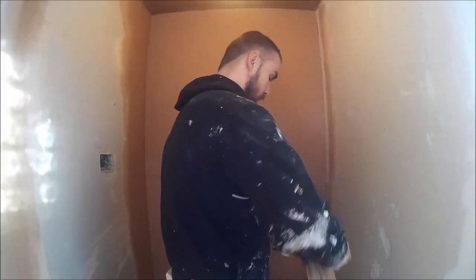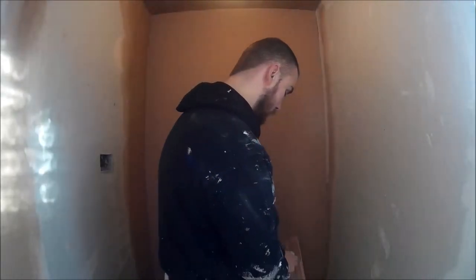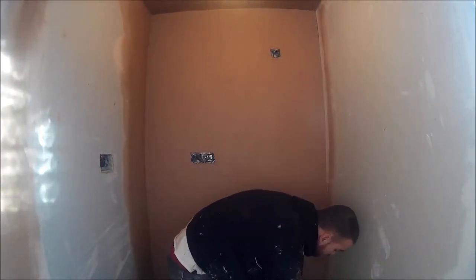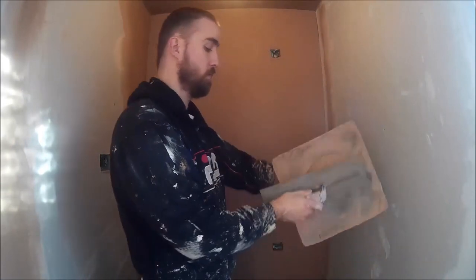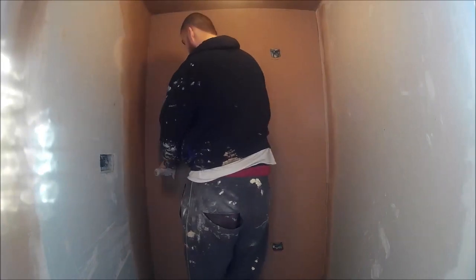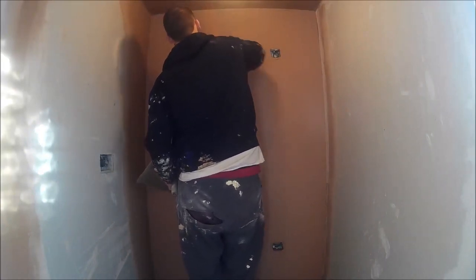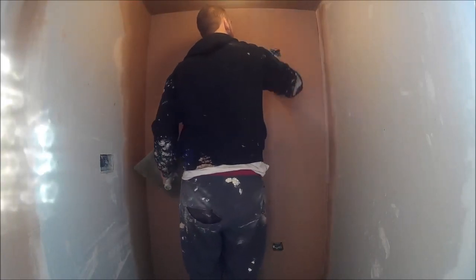Let's start coating, guys. They've already first coated this small wall in front of us and the wall behind us. Very important: keep the trowel clean, especially the back of the trowel. You'll be surprised how much quicker and neater you'll get with a nice clean trowel. Stuff on the back of the trowel deposits on the ceiling and angles, creating dirty lumps you'll just have to scrape and clean off later.